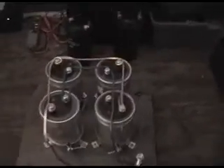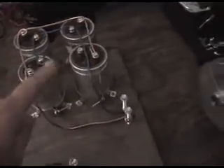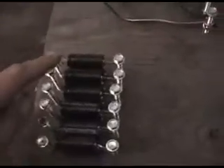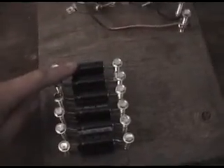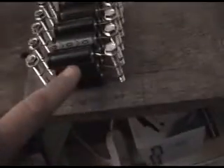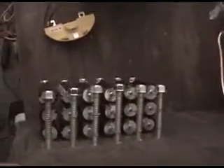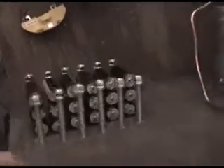Just wanted to show everybody that I got the capacitors mounted up — these are the bad guys here. They're not being used yet, I just mounted them up. This is the half of the MMC: one, two, three, four, five, six capacitors, three deep — that's 18,000 microfarads. As you can see, they're mounted in parallel. That's the negative rail, and that would be the positive rail.